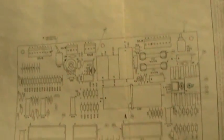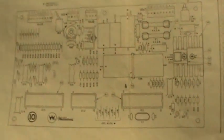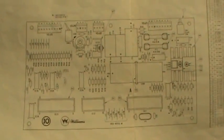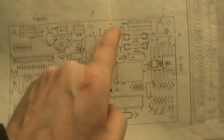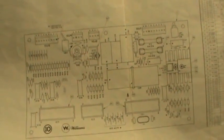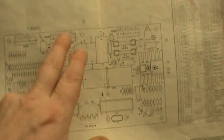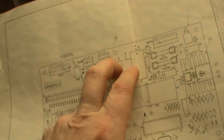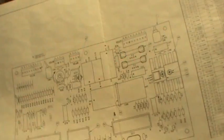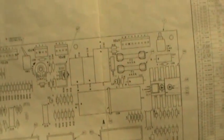Looking at the schematic, the board layout, and the bill of materials. I thought this was a System 6 Williams soundboard — that's what I ordered the cap kit for from Ed at Great Plains Electronics. I was expecting maybe 6, 7, or 8 caps. But I got a whole bunch of caps that didn't make sense, and the two main values I really wanted — the ones by the audio amplifier — weren't in the kit. Turns out this is Flash. I have a System 6 motherboard that somebody else must have put in, but the original soundboard is like a System 3.